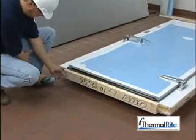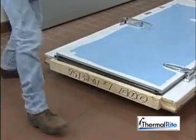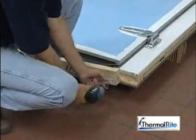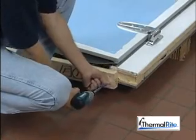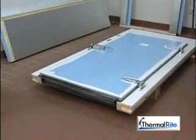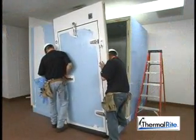When installing the door frame panel, remove the bottom shipping brace before attempting to install floorless coolers, freezers, and freezers with optional heaters in the bottom of the door plug. Freezers with 4-sided heaters do not have shipping braces. Do not remove the heater track which contains the heating element. Install a door frame panel just as you would any other standard wall panel.